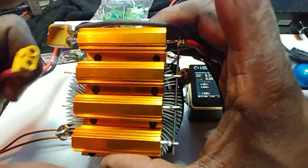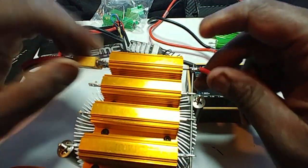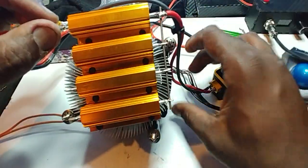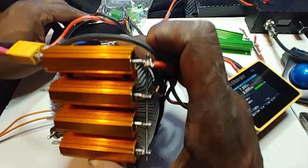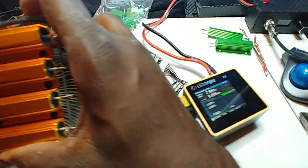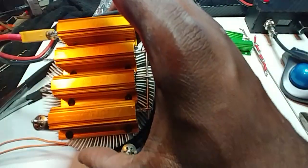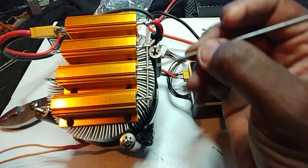So this is my jumper wire. The first resistor is lined in; it plugs in right there. This goes into the charger right there. Now my parallel connections — plus, plus, plus into the charger, plus into my battery. The balance lead has got to be plugged in. Let me set this so the cooling is working. The charger is just set at 30 amps; I basically just leave it set at 30.